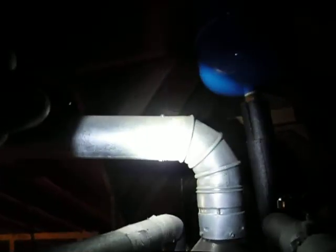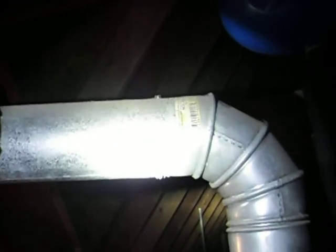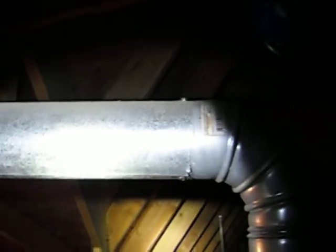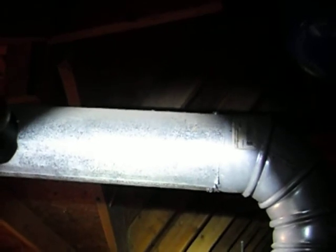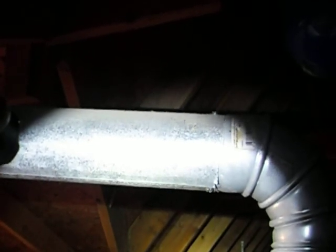The bottom end of this pipe has been cut. This is called a B-vent — B as in 'boy' — it's a double-wall pipe. When you cut the end of that pipe off, you effectively make it a single-wall pipe, so it gets much hotter than it would if it were a double-wall pipe with airspace in between the two walls. Cutting it breaches that design.